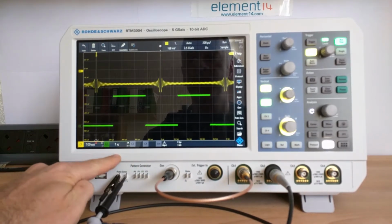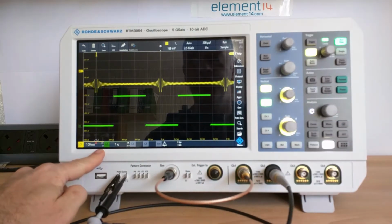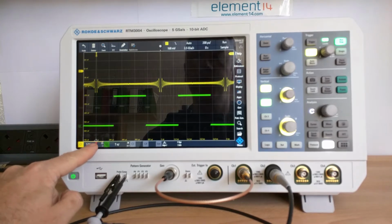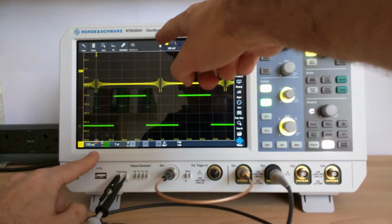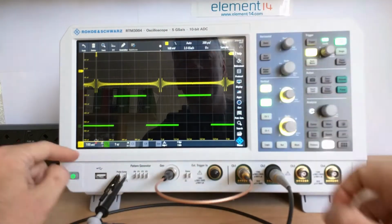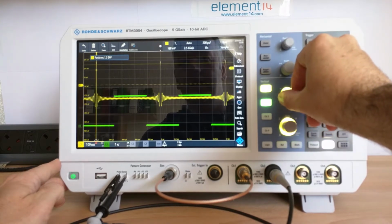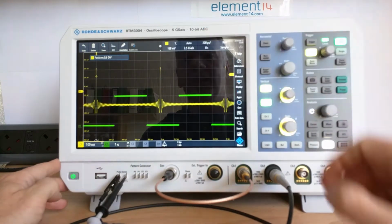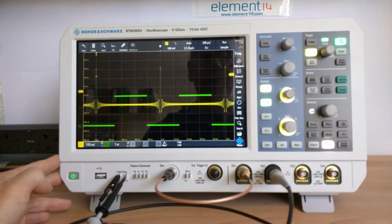Down here you'll see the settings for each probe. Channel 1 I've actually set to 50 ohm input impedance, and obviously 1-to-1, 100 millivolts per division. You'll see that nice little red arrow there. That's showing me something which perhaps you'll miss on a transient, which is the fact that the peaks here are going off the screen. So let's move that down a little. There we go. Now we realise that actually this is the peak here. It was a little bit off the screen. Perhaps not really obvious on this waveform, but sometimes with a sharp peak you might not notice that.